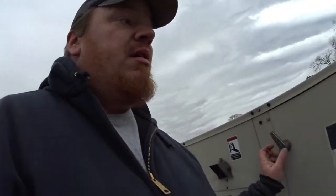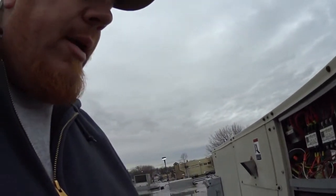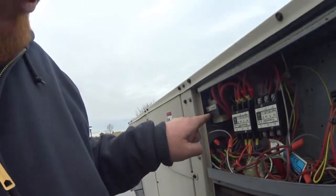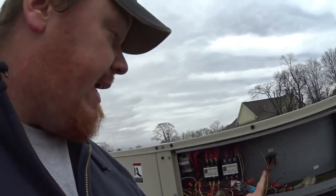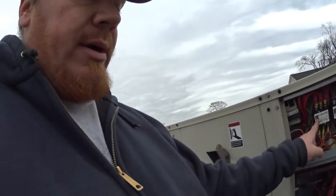Case in point. You've got this unit here which has nice access to the controls. However, why would you stick the transformer back here behind this mullion panel, with screws that way that you can't get to because the two contactors are here. The combustion air relay and combustion blower relay are here, and the combustion blower is here. You do have controls mounted in here for the blower delay — why couldn't you put it right next to the blower contactor?